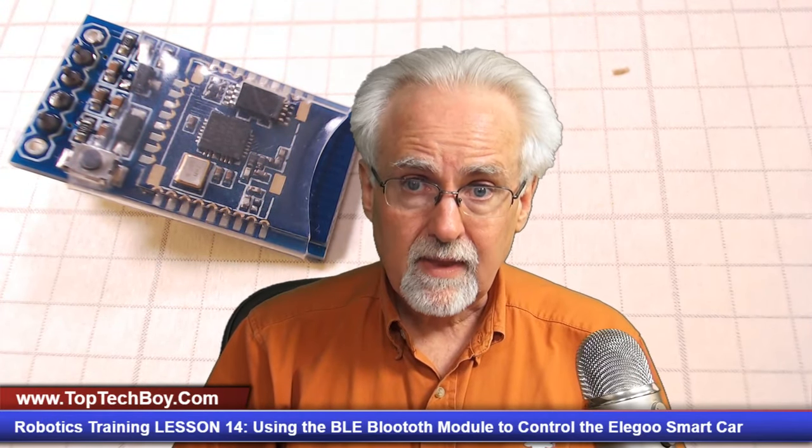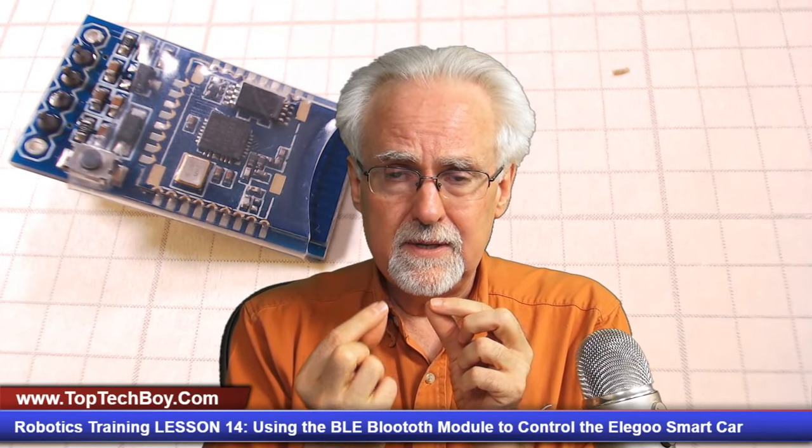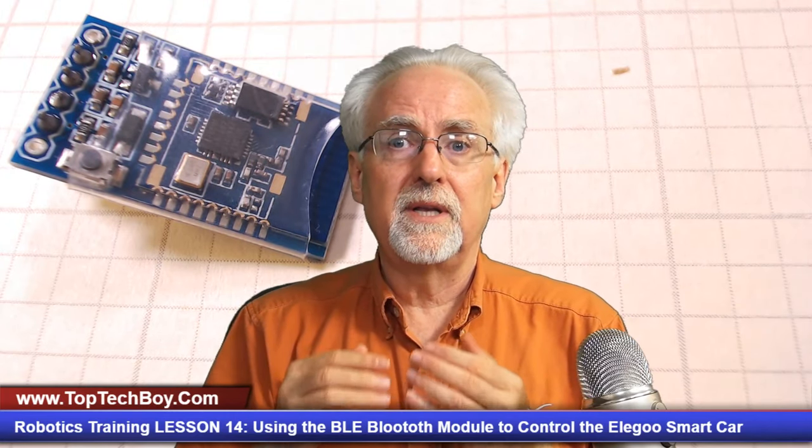Okay, but there are some challenges in using this Bluetooth module. And that is that Bluetooth operates over UART. What is UART on the Arduino? Well, it's several things. If you look at the Arduino, I think pins 0 and 1 are labeled TX and RX. UART is TX and RX. So when you plug this Bluetooth module in, you are connecting to those TX and RX pins.